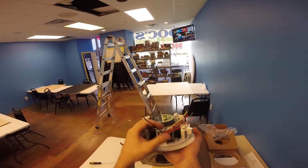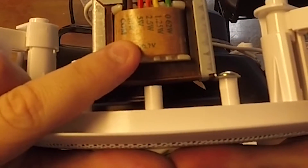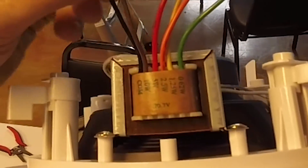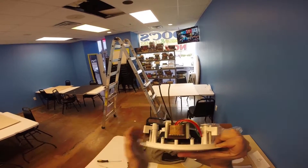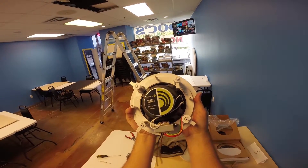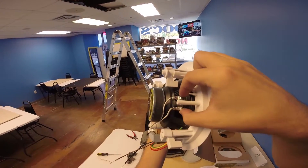You can choose which wire you want to connect. It's just two wires — you only use one pair. The first wire on the left is ground, and then every wire after that you can tap at a certain number of watts. The first two are tapping it for 10-watt operation, which is the highest amount of watts for this particular speaker. If I wanted it to operate at 5 watts, 2 watts, 1 watt, or less, I could have chosen one of the other wires, but I didn't. The output of the transformer is attached to the speaker.